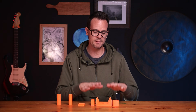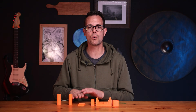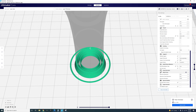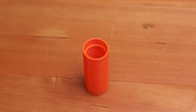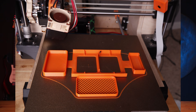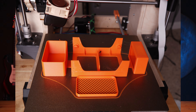For the 3D printed parts we have the base, the desiccant lid, and two rollers. You don't need any supports when printing the base or the desiccant lid, but the rollers do need some support. I recommend setting your slicer to concentric support — all it does is print a little extra ring in there that's super easy to pull out and hardly adds any time. These parts have been optimized to print with a 0.3 millimeter layer height using either a 0.4 or a 0.6 nozzle.